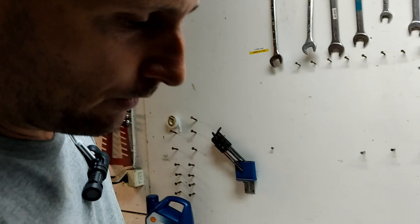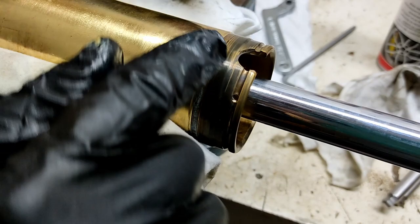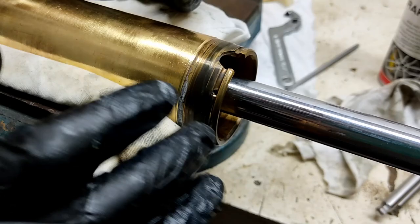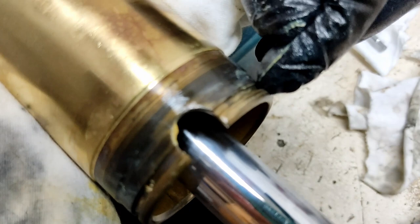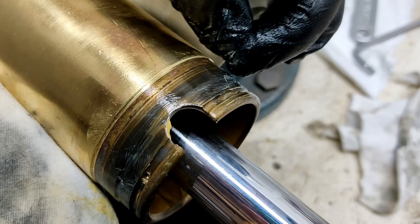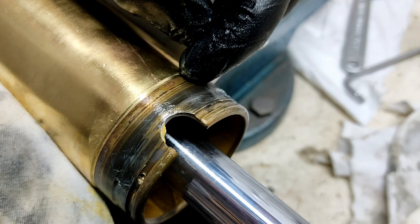On the back end here, we have our O-ring seat. So this is where the O-ring sits and seals, so we need to make sure that that's lubricated, because with these O-rings, they're round. When I push it in, I don't want the O-ring to roll out or roll under or twist. I want that O-ring to stay in its natural sitting position and shape. So I need to lubricate this surface up here, with our O-rings gonna slide over it. And again, they've machined a nice little radius on this edge here for the O-ring to initially slip over. Then we have a sharp shoulder here, which you've got to be a little bit careful. And then they have a step up ramp, which is the final landing face. This step up is the final ramp, it'll go up before it's squeezed in position to sit on the seal surface face here. So that's the O-ring, that's no worries.